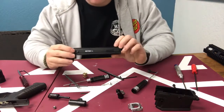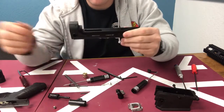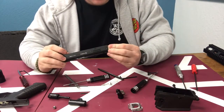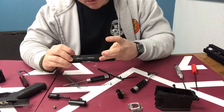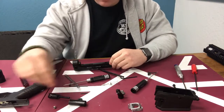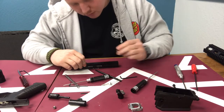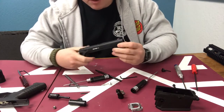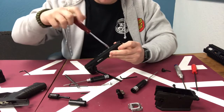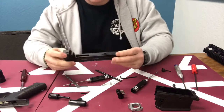From this point we can go ahead and reinstall. There's really no maintenance you need to do — just make sure it's nice and clean. You can run a squeegee through there; there is a pin going through the middle so go one from the front and one from the back. When reinstalling, make sure the hole is in the upward position and push this in with your finger — just take your pinky and push it all the way back until it's flush. You can use an Allen key or the locking pin to make it nice and straight. We want that hole directly in the center so that when we put our locking screw back in it'll go right into that groove. Tighten it until it's nice and snug — you do not need to over-torque it.